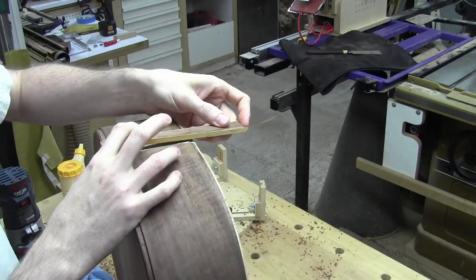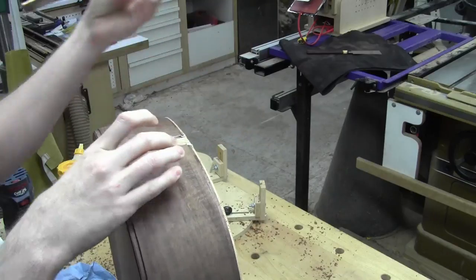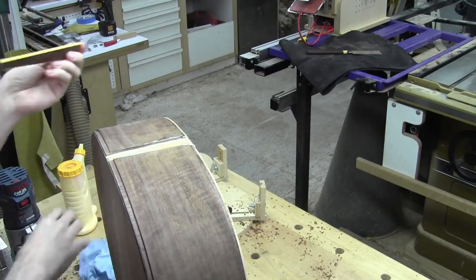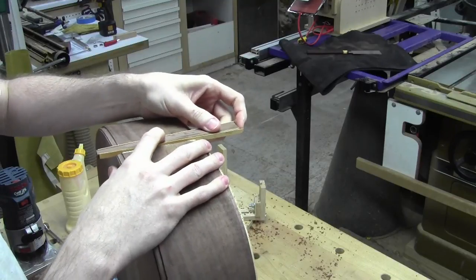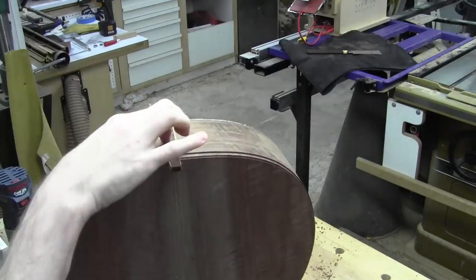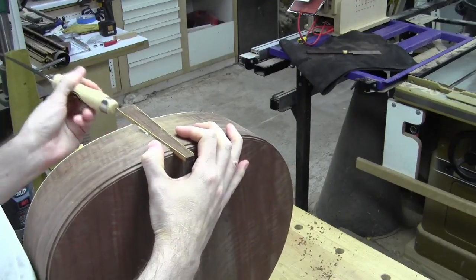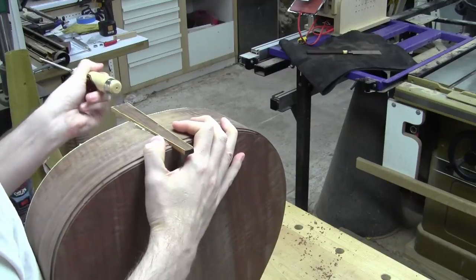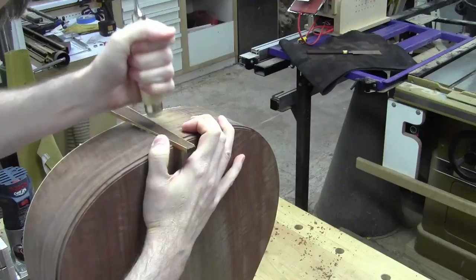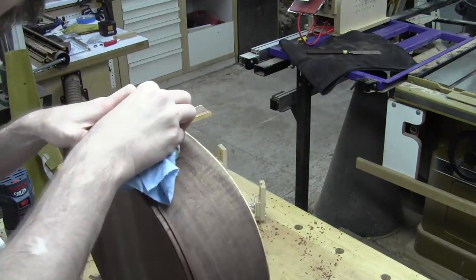Okay, just slide on down to it nearly and get some good coverage. It's really a lot of glue. I'm going to wipe that excess off, because there's way too much glue there. One more little oozing. And I'm going to let the wedging action, in fact, I'm going to tap it just a tiny bit with my chisel, I suppose. Seated. Seems like it is. Good. Now we'll let that dry after I wipe some of this extra squeeze out of there.